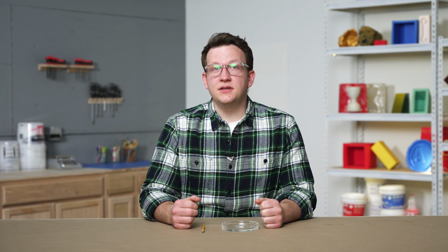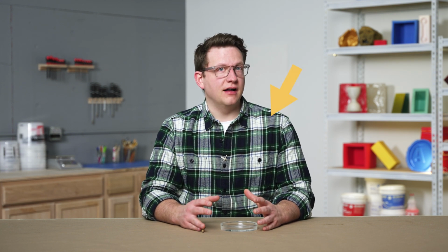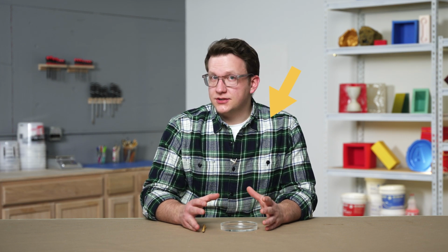We'll need to determine the size of our mold, its general shape, any specific techniques required to make it, and what properties we need from our silicone. Let's answer each one of these questions for our glass tray. In order for our mold to work well, we'll want about 1/4 of an inch to 1/2 inch of silicone around the outside of our master. That will make our mold's diameter 5 inches if we're adding 1/4 inch to each side. For our height, we can add the same 1/4 inch above our master's height to give us 1 inch.